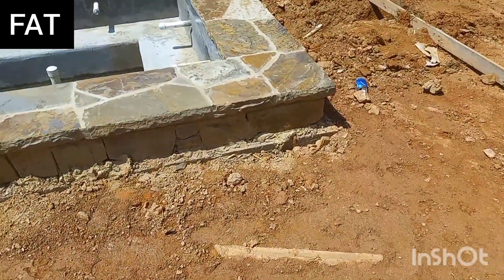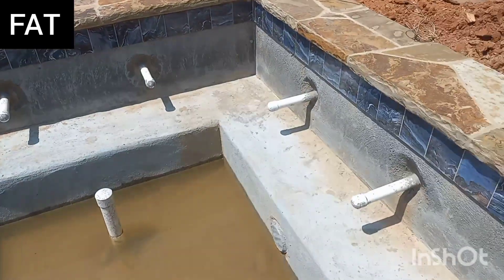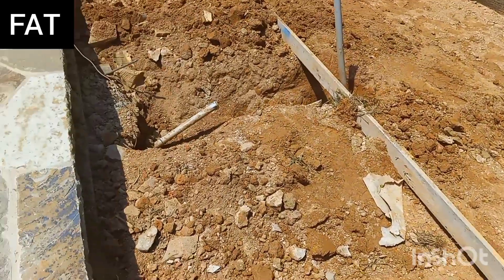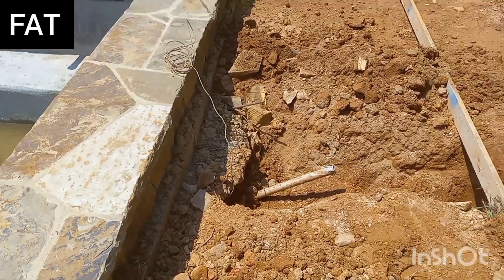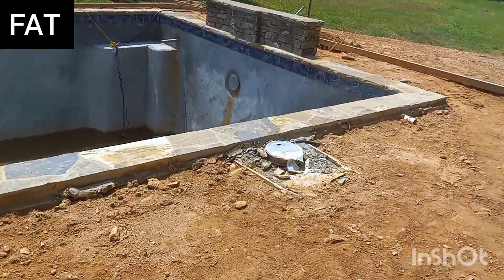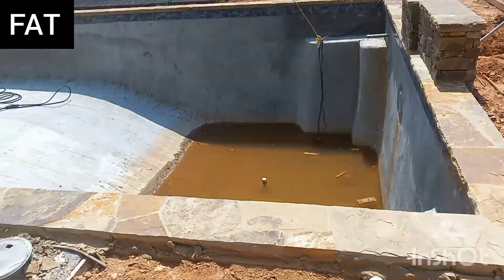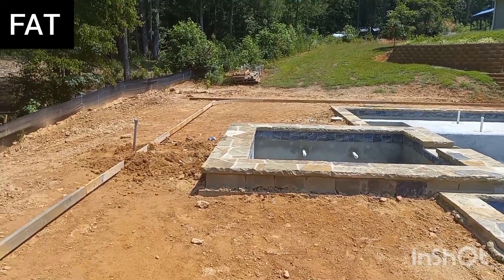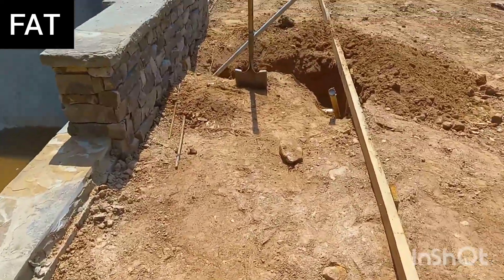Each one of these has a light niche in it — there's the light niche, see it? We've already attached the ground wire to the back of that light niche; there's a place to attach it. We're going to take a split bolt and attach that to our ring that goes around. This particular pool has absolutely zero handrails — there's zero metal within six foot of the edge. So if you've got a fence within six foot of any metal, it's got to be bonded. I usually go 10 to 12 feet. The code's a minimum standard — I think six foot is what the code says.